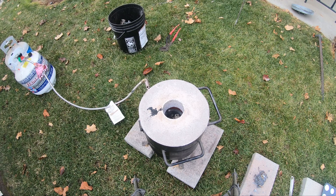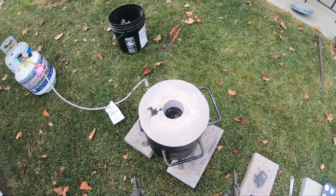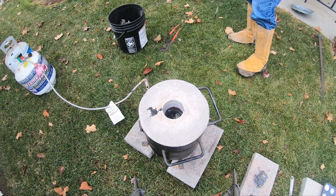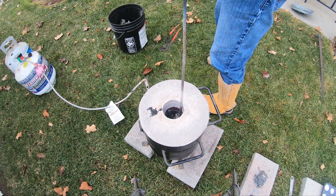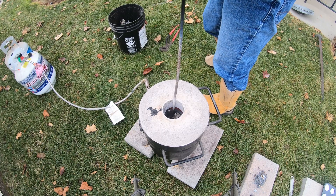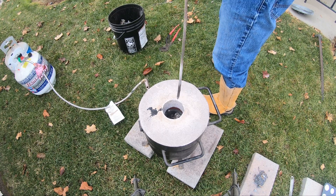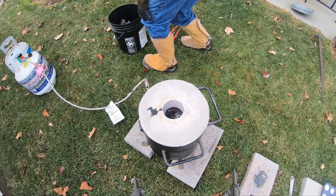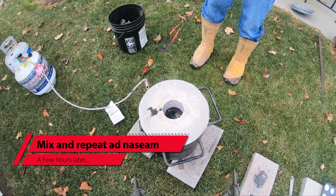So eventually I did get smart and start preheating some of the pieces. The problem with that — as you can see there's that nice dark black spot on top of the furnace — was because there is actually plastic in some of these lawnmower parts that I got. I think most of these were carburetors, small parts. I had some plastic pieces that I couldn't get out, so when I went to preheat them, of course they melted on top of the furnace. I guess that's better than melting in the furnace and smoking up there, but at the end of the day it made a mess regardless. So you can see that small mistake here.